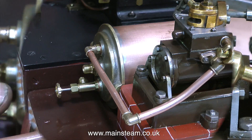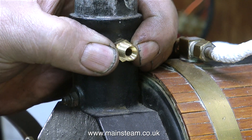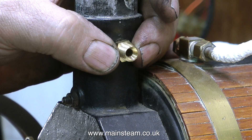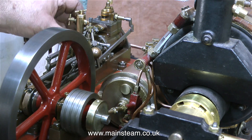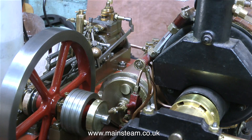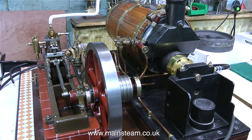That's about it for this episode. All that's left to do is run a quarter inch pipe from the large union in the centre of the condenser through the bracket on the bed plate at the back, and as the quarter inch pipe exits this bracket, I'm going to fit another PM Research elbow to take the pipe at 90 degrees up towards the chimney. I'll be covering the finishing off, the making of the blast pipe, and the testing of this in the next episode. Here I'm straightening up the displacement lubricator — you can see the condenser clearly between the engine and the boiler. Even though it's quite a large item, it seems to be quite in keeping with the plant. And here's a shot of the engine from the other end where you can't see the condenser at all. Thanks for watching, and I hope you found it useful.